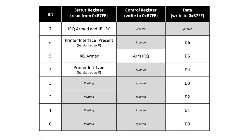For the techies out there, they can pause the video here to see details on the registers. The three registers have been partially decoded based on the schematic and by reviewing the 6502 assembly code for the keyboard component. This decoding is not perfect, and corrections will likely be made in the future. Of particular note is bit 6 of the status register — it is tentatively understood that this bit is read by the keyboard component's built-in driver code to detect whether the printer interface is plugged into a back-expansion slot, which is why this bit is hardwired to 0 by the printer interface.